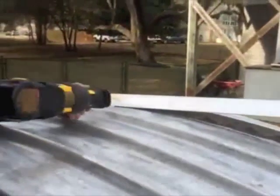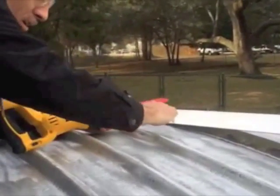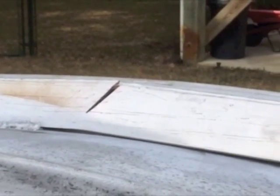Right here where this starts to open up and form a gap, I'm going to cut and notch it, then roll it down. So we've notched it — now we bend it to that point right there and tack it right there at the closest point where it touches. Then we'll make another notch and roll it on out some more.